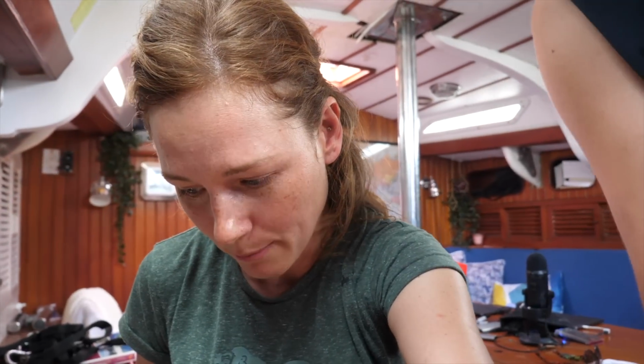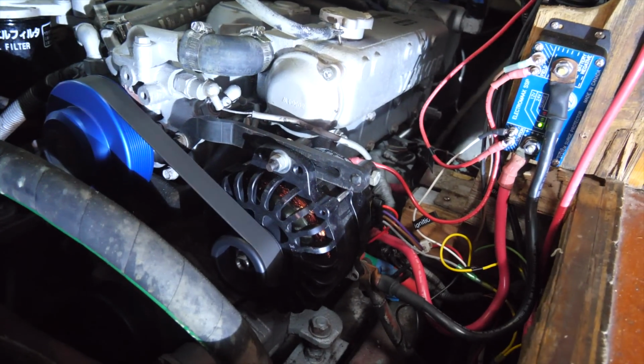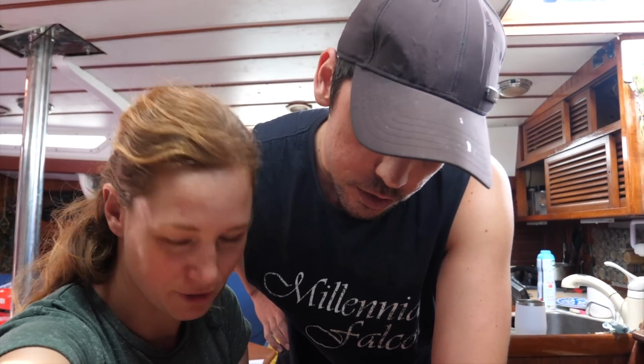Alright, because right now we're currently drawing 9 amps. That's 17 amps, that's the boot up. So, just waiting. Okay. It's running smooth, alternator's running smooth. Right, here we go. 52 amps at idle, so that's good. This alternator current is starting to now increase. I'll put some revs on too and see if it picks up. Alright, so Adam's just put some more revs on the engine.